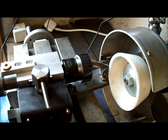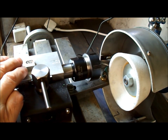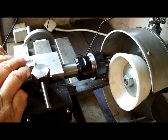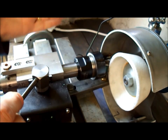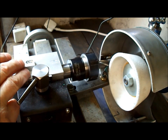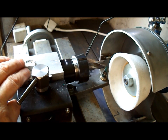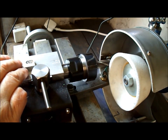Cut it off. Now we're in this position here — push it down following the finger. When you get to the end, you throw that and it moves that over slightly, a sixteenth that way, taking the cut off, and bring it back. Re-engage the next flute, put it back on, take the cut.